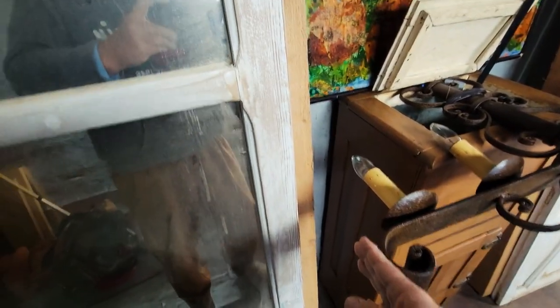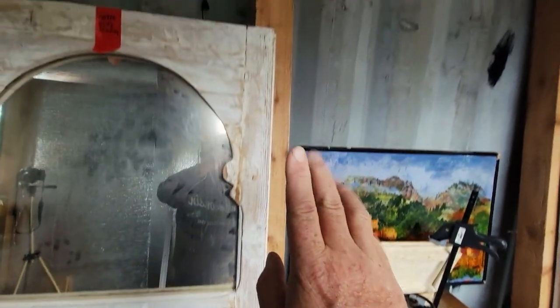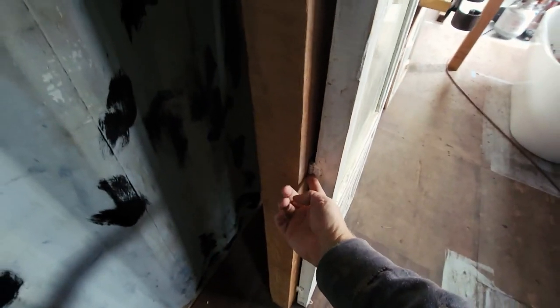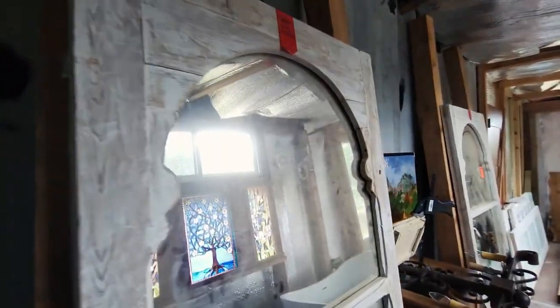The doors are 27 inches apart and they're going to rest on the front of the cedar post. I'm going to make a box 12 inches deep, so I'll have storage that's 12 inches deep behind these. They've already got hinges here and here — blacksmith hinges. I'm not sure what pin will go in there, but I'll cross that bridge when I get there.